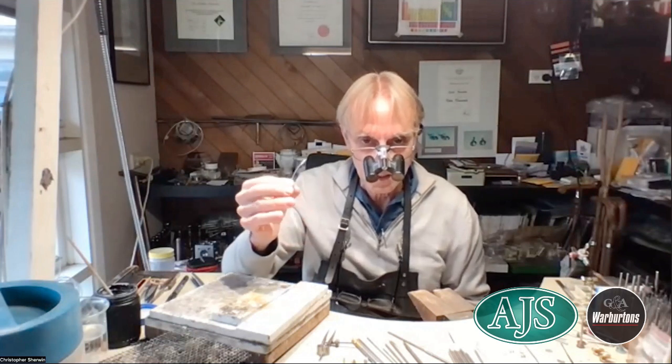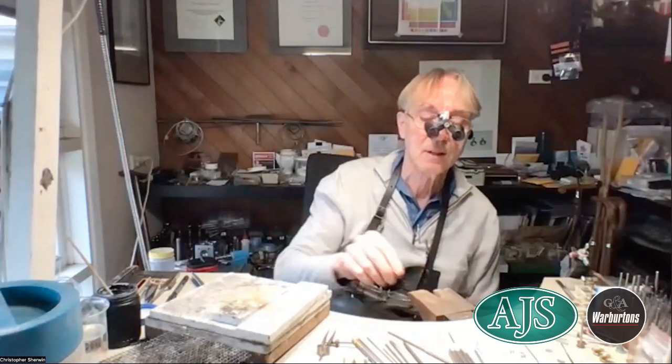No worries. Thank you for that question, Dawn. Good question. Thanks for the answer, Chris. And then also make sure you pre-tension your wire. So draw it through 3 or 4 holes in the draw plate to give it some tension. Otherwise, it's going to be too soft.